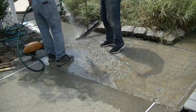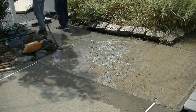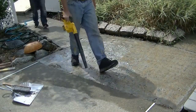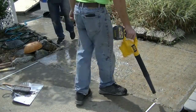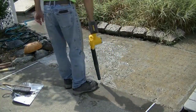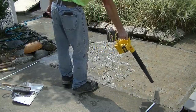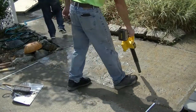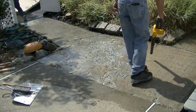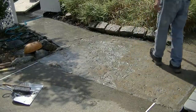We'll remove all the dust and debris and get the surface nice and damp. We'll also remove any little puddles in those deeper areas — you don't want any standing water. We're using a little DeWalt battery blower to remove any standing water in the deeper areas before we start doing the repairs.